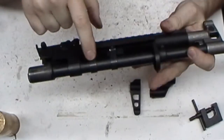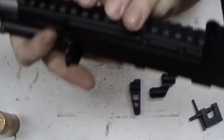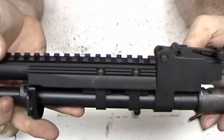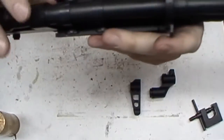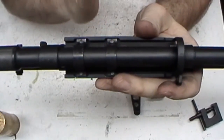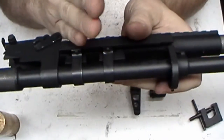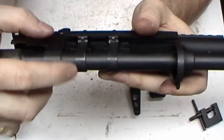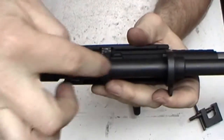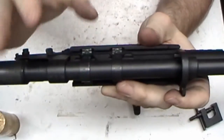And when you put these on, these little bands, if you're using an Ultimak, like this one is, let the camera pick it up. It's the M1B. But either one, these little barrel bands here, make sure they're straight. Sometimes when you go to lock this thing down, one of these bands can slightly be kicked over, where it's touching on one side, but it's not touching on the other. Then you lock it down, then you get it all hot. The next thing you know, it does move a little bit. Make sure they're laying flat and they're perfectly straight. Don't let them tilt a little bit, because they will when you first start tightening them up.